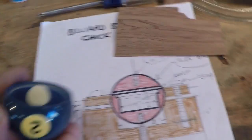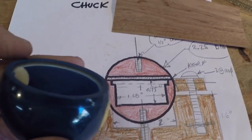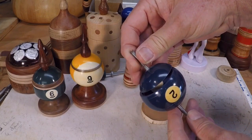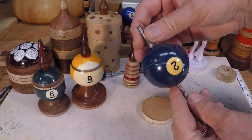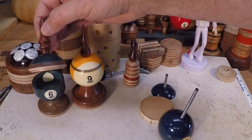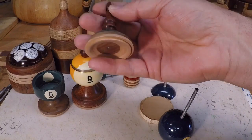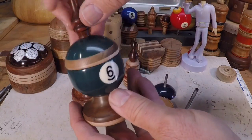It's pretty much like the drawing — it's got the little step. I made it a little deep but it doesn't seem to be a problem. When you cut the top of the ball off there's the kerf to consider, so if you set the lid down it kind of disrupts the geometry of the sphere. To address that, what I've done with these others is CA glue a piece of wood to the bottom of the top, then turn that on the lathe to conform to the bottom and provide the register.